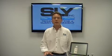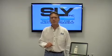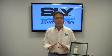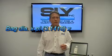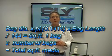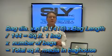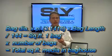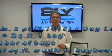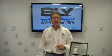If you don't know how many square feet of media your filter bags have, you'll need to take measurements. If the filter is a tubular bag, you simply take the bag diameter, multiply it by pi, or 3.1416, multiply that by the bag length in inches, and divide by 144, and you get the square feet for one bag. Multiply this number by the number of filters in the unit, and you get the total square feet of filter media in your dust collector.